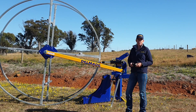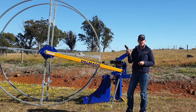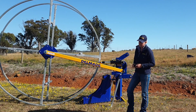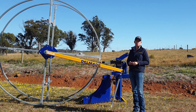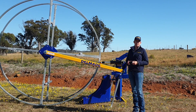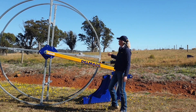With the 105mm, we can fit a 2 inch pipe with a regular fitting, and we can also fit a 63mm or 2.5 inch pipe if you're poly welding. With the 150mm, obviously your options are much larger and you can go 63mm with a regular fitting if you choose.